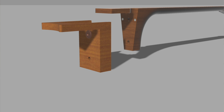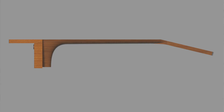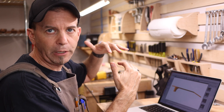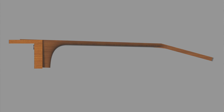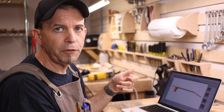With the two grub screws at the top and the support rod in the center, everything fits nicely and square inside that block. Looking at it from the side, if we've done everything correctly, we should get roughly two degrees of movement. We only need downward movement on the neck, because over time the bridge is always going to lift due to string tension — so we only need to go in one direction to compensate for that lifting and lower the string height. Two degrees of movement is a lot — that would be a massive amount of material to remove in a traditional neck reset. I'm hopeful that we'll get all the movement we need just with a few twists of a wrench.